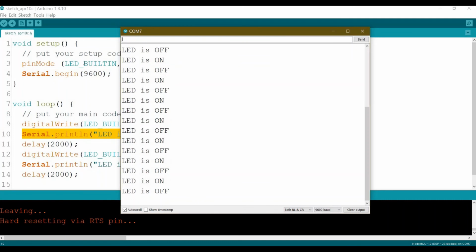If you remember, you can use the AT command, the attention command, where you say AT, then it will reply with OK. Then you talk to the module with different commands. This will not be active anymore because you override the firmware. Then you need to re-burn the firmware inside the ESP8266. But I believe it's more convenient to use real coding directly inside the ESP instead of just using the AT commands to do your required code.